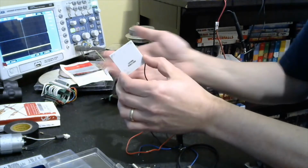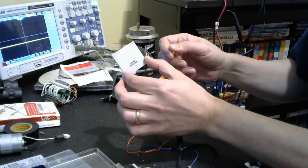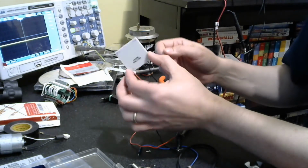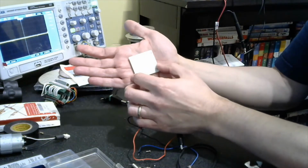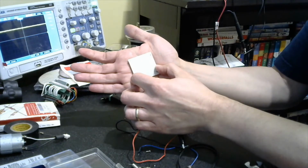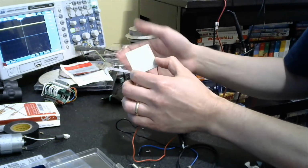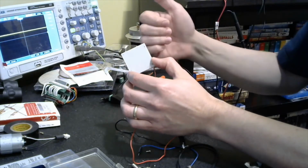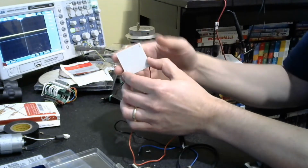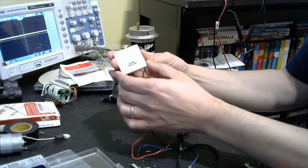And if we flip-flop it, let it return back up to ambient temperature, and put my warm hand against the other side, the voltage goes positive. So you can imagine the same kind of response curve happening when you're putting voltage into it and it's actually making heat or cold on one side or the other. So this is actually a really cool device.